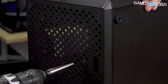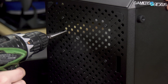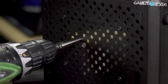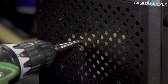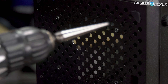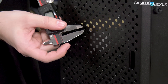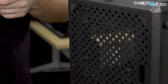This worked really fast. That was the 1/4 inch marker — we could make it wider. The question is: if we drill the neighboring holes, do they start colliding with each other? That's looking pretty good. These holes are 5.27 millimeters apart, and these are 4.4 millimeters apart. I think we could do a little bit better than that.